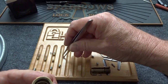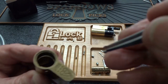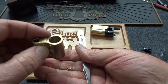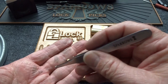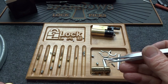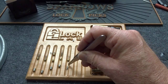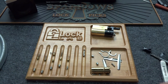Pin four and its baby trap pin. Pin five — these guys are all serrated. The next one has two baby pins plus more. What a mess, what a nightmare to try to put back together. Two little side-pin trap pins per stack. Let's see — four, five... this was five. So pin five was this magnetic spring-loaded pin, and all these little baby ones are the six trap pins. I will never get this back together — I don't have the tools or the technology.